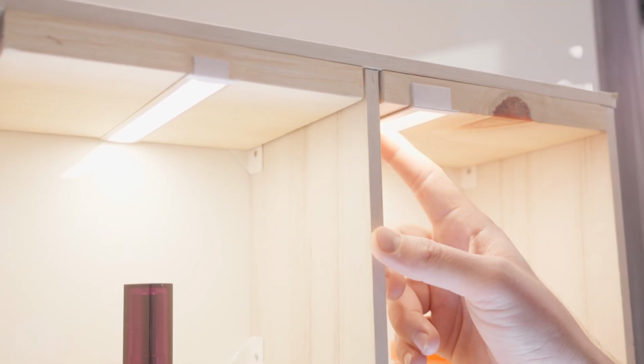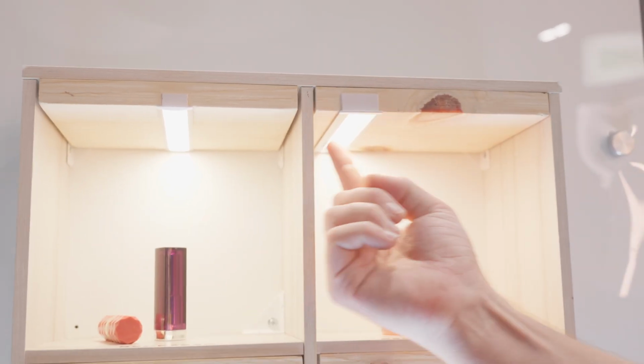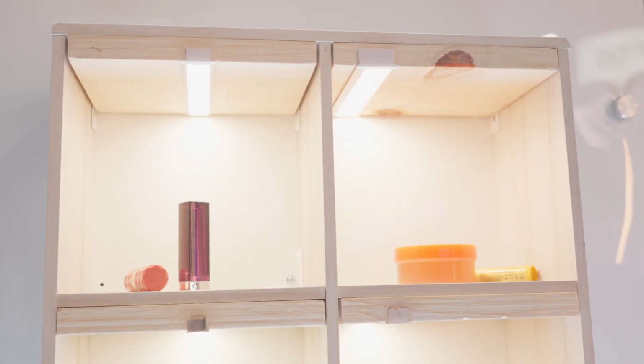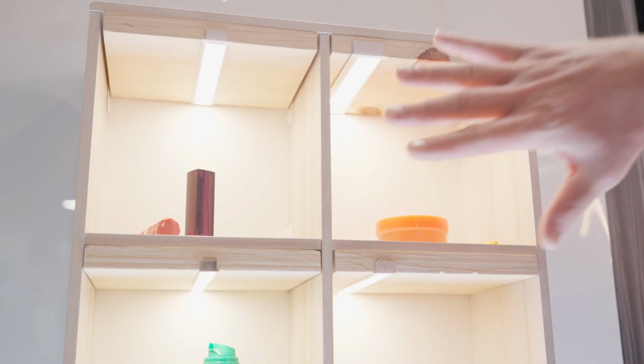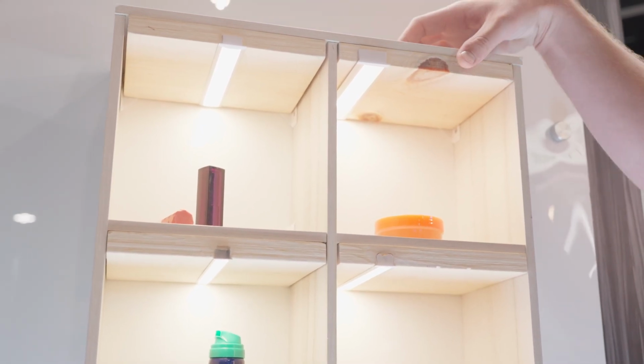But notice how the lens right here is angled and it's shining the light back. So if I had this horizontally mounted into floating shelves, a cabinet, doesn't matter. Now you're not just seeing lines of light through your viewing angle. This is creating a floating effect, and the light is always being directed away from your eyes. So really unique way to do recessed millwork, but also keeping that light away from those eyes and having good glare control.